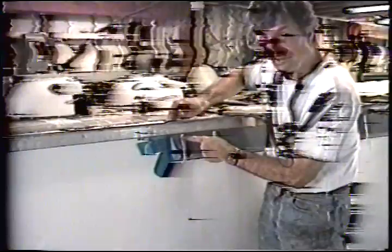And now the ribs that were in there before, we make certain that they were all drilled so they could breathe. We'll have to talk a little later about letting the aileron breathe to the outside atmosphere. I haven't exactly decided where I'm going to have the aileron breathe to, because I don't want it collecting water. That could be rather bad for balance if that water happens to be in there and then freezes in position at altitude. Essentially, this is how we're going to let it bond.